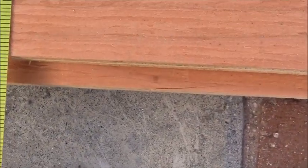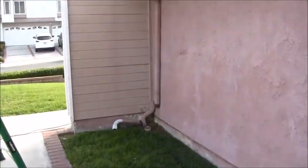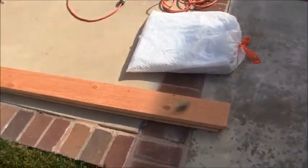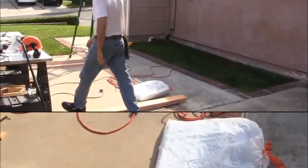I had it cut at the Home Depot, and they were supposed to cut at 5.75 inches, so 5 3/4. Sometimes those machines are not the most accurate. And for this project, I don't have to be 100% accurate. But where you want to be as close to accurate as possible is because I'm going to start over here on the left and work out towards the right. These boards are going to mate with one another, side by side. The idea is that where the mating surface is, you want that to be about the same height.